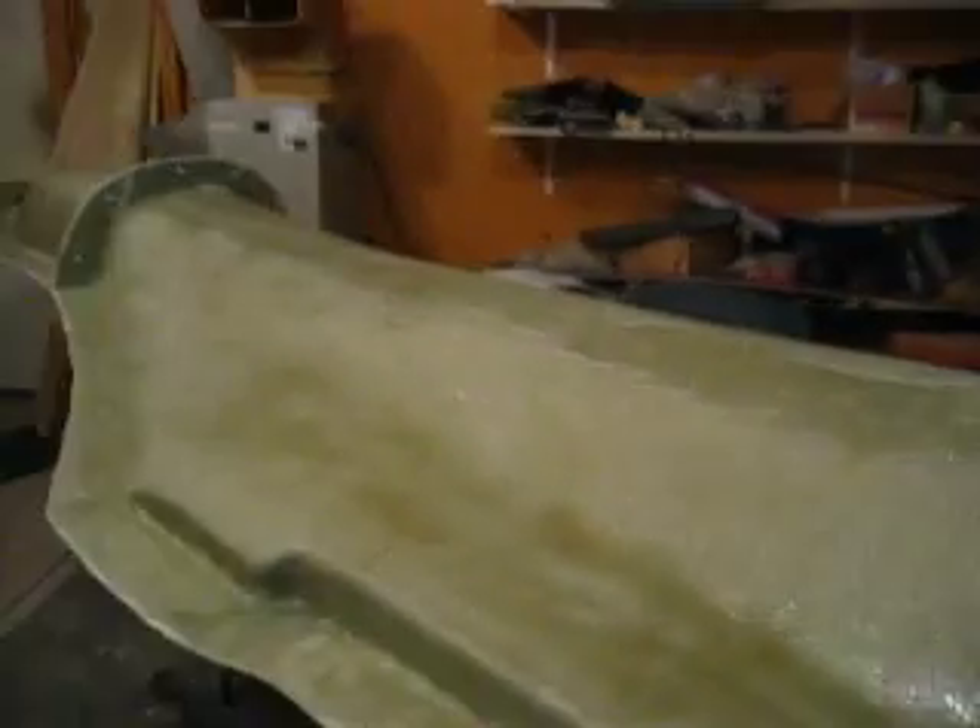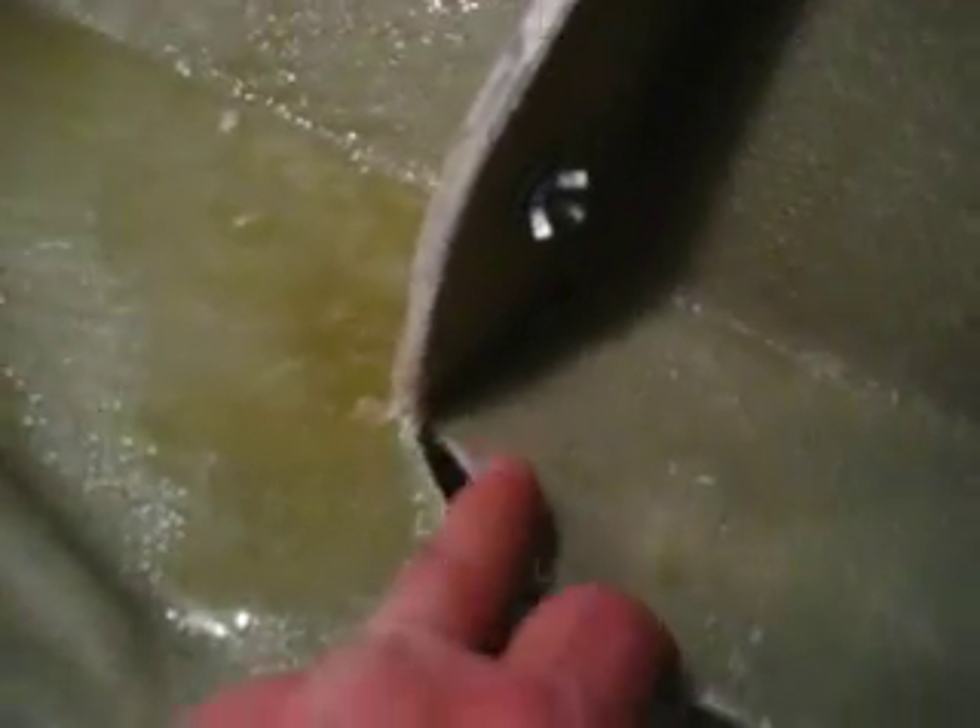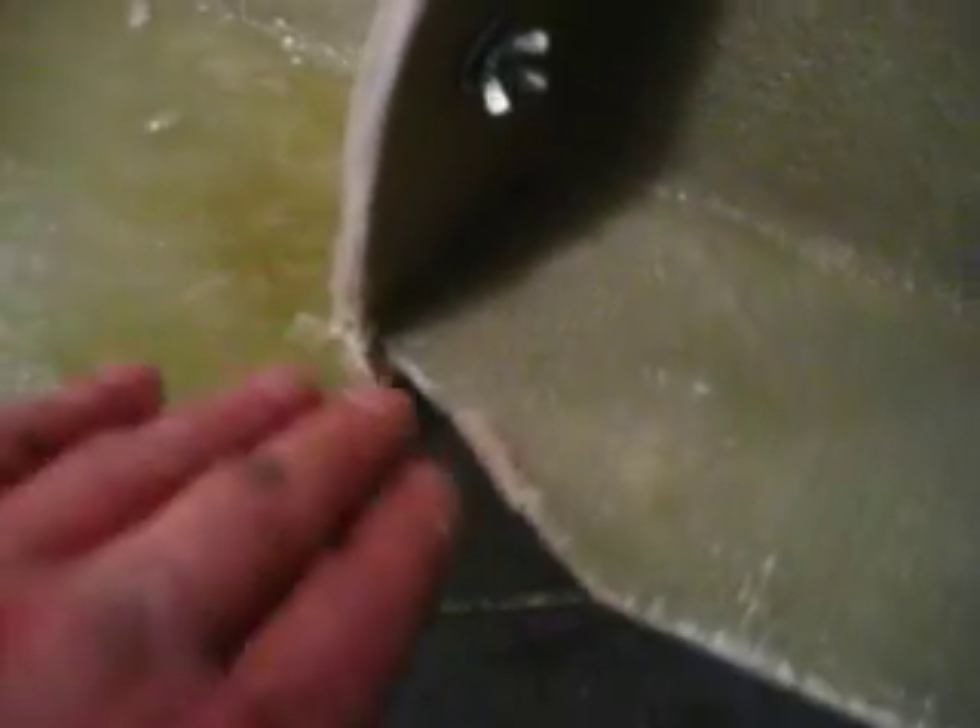And there's about 12 gallons of resin on here — I sure hope all this comes off. But you always have to be aware so you can get your parts out. I took this edge and backfilled it with clay a little bit so I wouldn't get gobs of resin on there when I laid all this up. And then I was real careful with my jigsaw and cut it right to that mark, so they should just come off right in tandem.